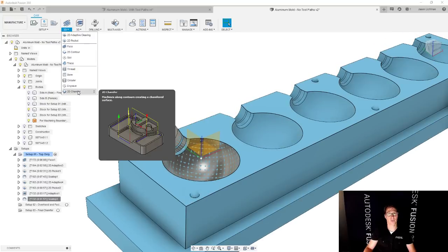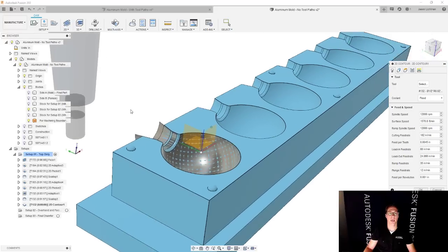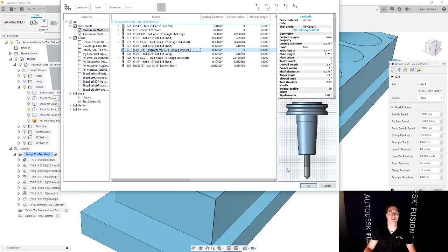I'm not going to cover in detail how you choose which one of these for this video, but we do have several videos that cover that, and we can put a link to that in the description here. But I'm going to use 2D contour, and I'm going to change this to be a chamfer mill. I think it'll do a much better job at chamfering. So we're going to use a chamfer mill.